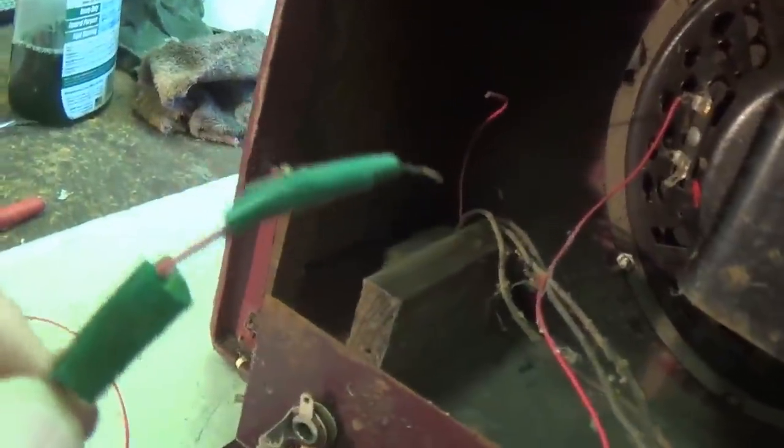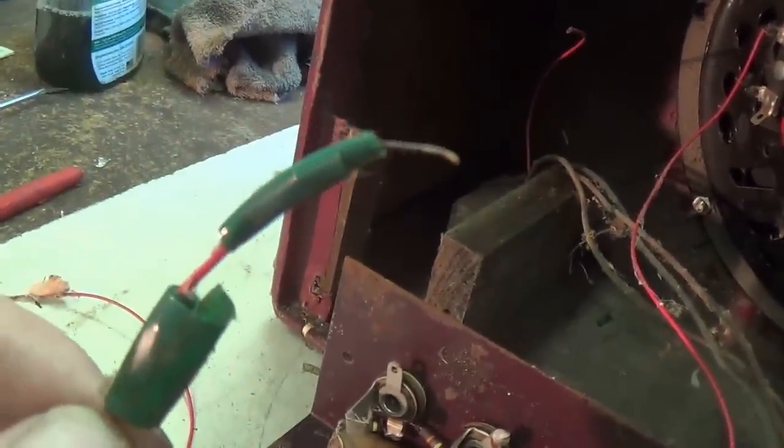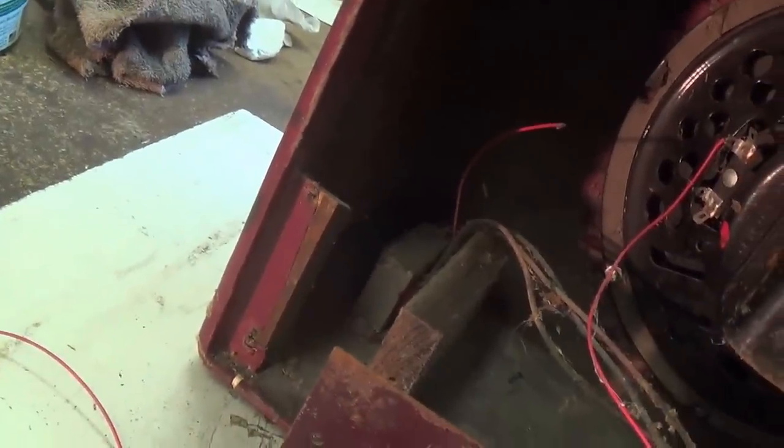This is never a good sign. One of the speaker wires was loose, and you can see where it's pulled right out of the secondary of the output transformer. If I can't find where it went and reconnect it, I guess I'll have to replace that little jewel lurking back there in the darkness.